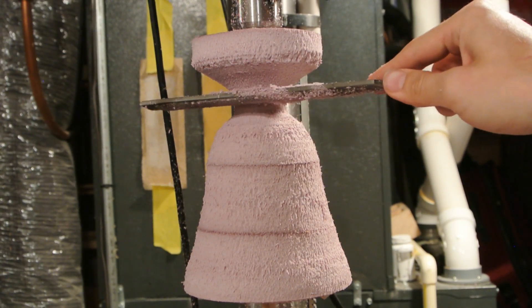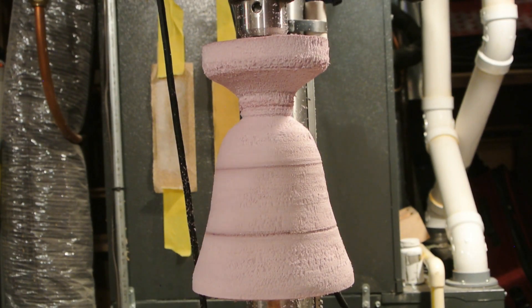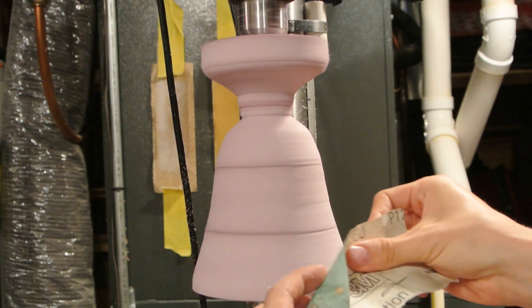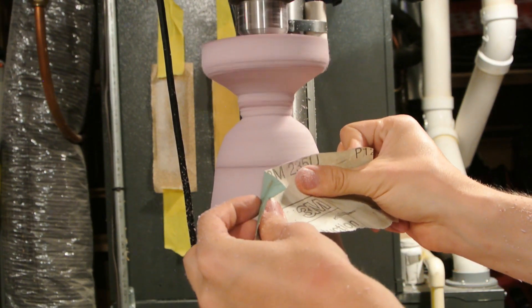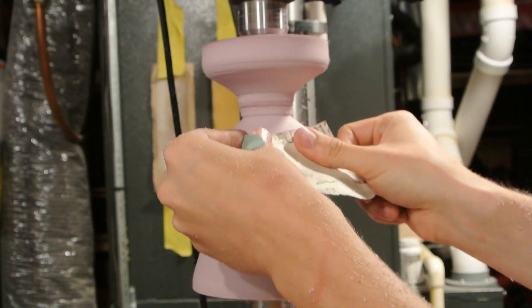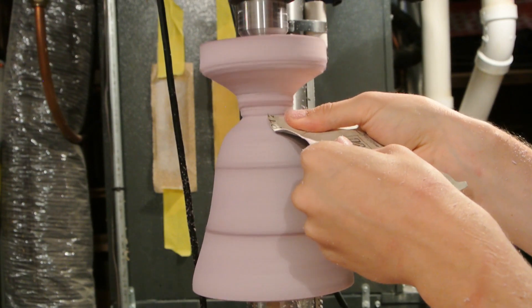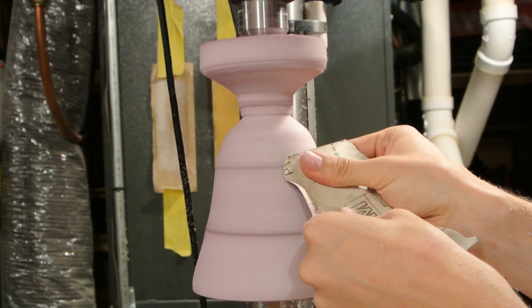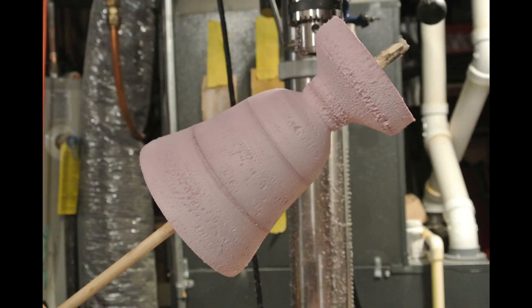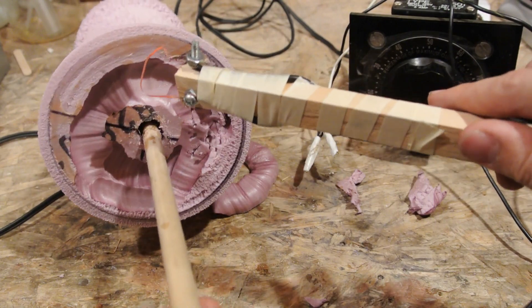After a while I was left with a shape that had kind of a block of foam left on the top — that will get cut off later, but for now it's useful as it provides more support to the piece. I started sanding, beginning with rougher sandpaper and working my way up to about 220 grit. It's not really useful to go much finer than that because at that point it'll just clog the sandpaper and not do much to the foam. This is all going to be sand cast anyway, so it won't really preserve all that much detail. The goal is just to make it not super rough and to remove the marks from the rasp. The whole setup on its dowel rod stick looked kind of like state fair food — something on a stick.